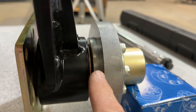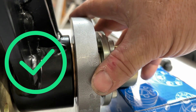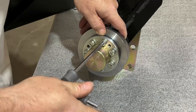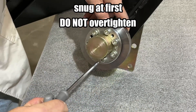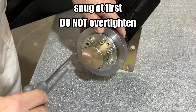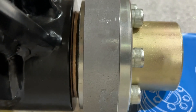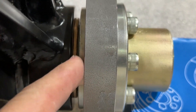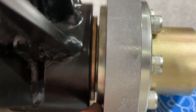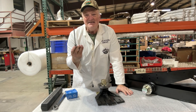Make sure that your bore ring is aligned with the back of the shaft lock collar. Once everything is aligned and properly fit, start tightening up the bolts in a star pattern. After going one time around, come back and check that everything is still lined up — the bore lock collar can shift, so readjust if needed. Go around at least four times in a star pattern until all bolts are as tight as you can get by hand.